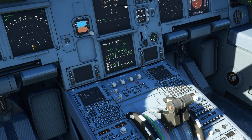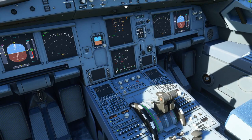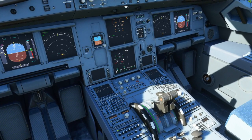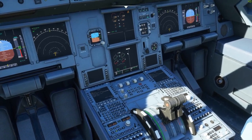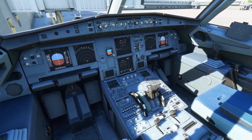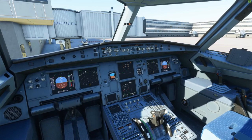We also check that the engines have enough oil. We're showing 25 quarts here, and for the Neo, 14 quarts are required for takeoff, or 16.5 quarts if it's minus 30. We have plenty of oil for the Neo engines — the Pratt & Whitneys. These ones technically have the LEAPs on it, but I only fly the Pratt & Whitneys, so we're moving on.